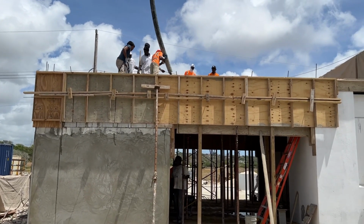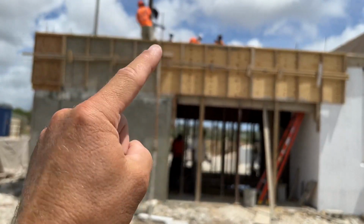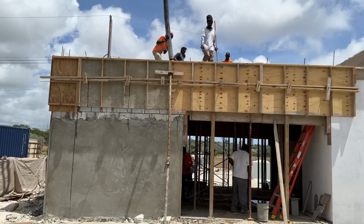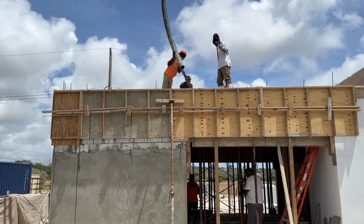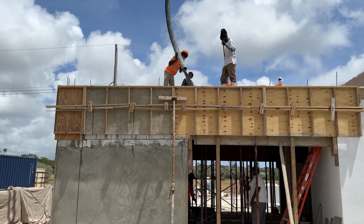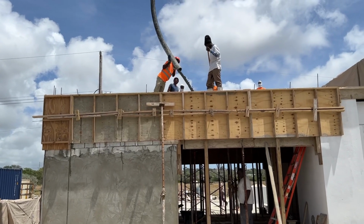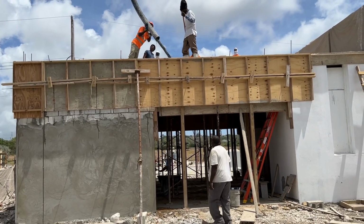Honeycombing is when from the side you just see stones. It looks like a honeycomb. Loads of stones, loads of gaps. That's not good. You need as much concrete down the side as possible, so it enables the waterized concrete to come down the side as well. Honeycombing here is not good near the sea, because it enables the salt and the air to get in.